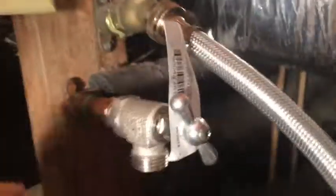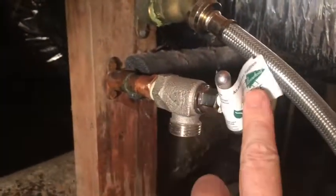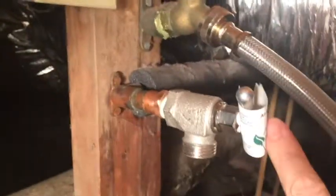Let's give it one last check. That looks nice and plumb. And if it was leaking here, it would be fine to turn this another quarter turn and just have the hose come in that way. I couldn't do another full turn, but another quarter turn and the hose would just come out like that — that would be fine too. I'll just leave the tag on this for the homeowner — they can see they got an American-made, lead-free hose bib.